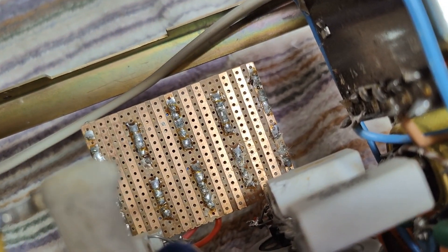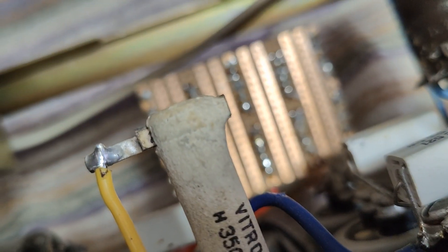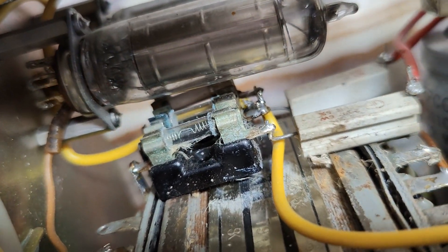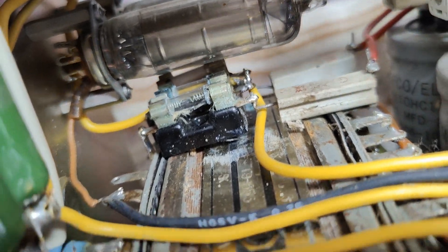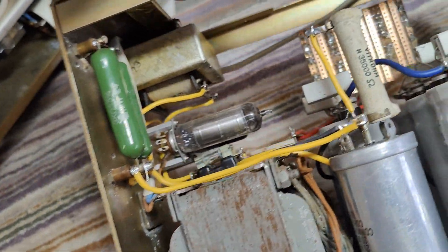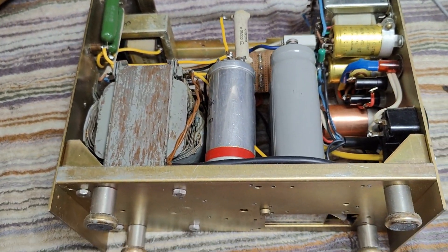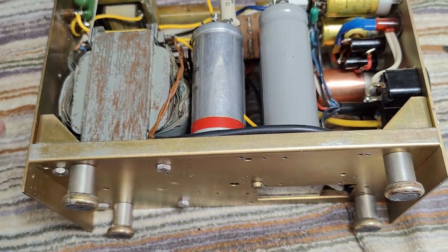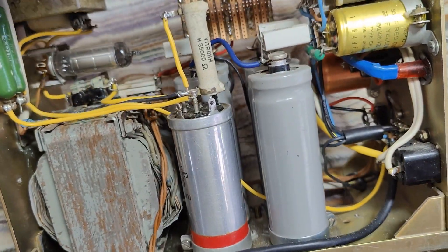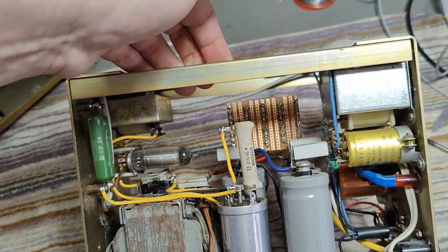And again, the high voltage rectifier — he didn't remove all the copper on the backside, just so you can have a little bit of spark-over risk. There's also nasty corrosion on the fuses — a classic problem. More resistors and all that kind of stuff. It's not the worst build quality, but it's also not the most safe. I would go as far as calling this definitely dangerous.